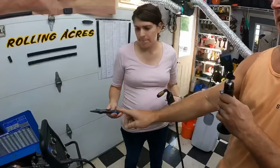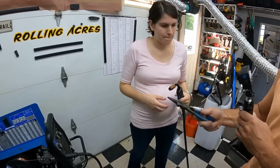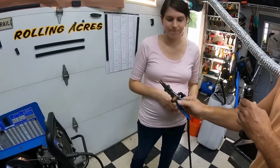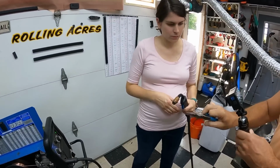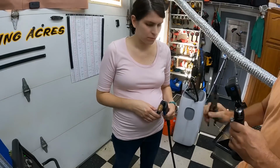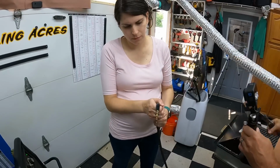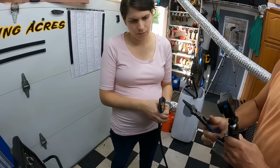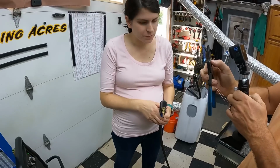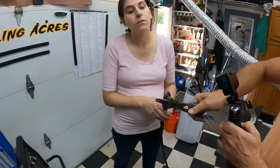That's what they call these, welding pliers. They do a lot of different things. If you needed to crimp on that, or undo that, you've got the cutter in here for cutting your wire. And if you take the cap off, go ahead and hold that real tight. Now if I need to take the tip off, it's got this V groove right in through here. That is to unscrew that tip.